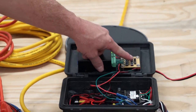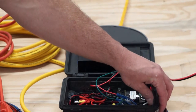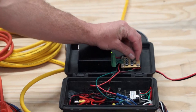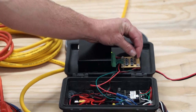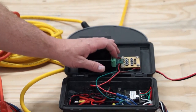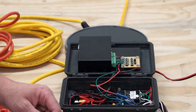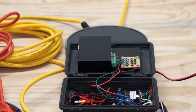If you'd like a different tone, place the jumper pin across any of these pins. Right now, if I press the button on the outside, it is set to the tinkerbell tone. If I want to set it to the next one, I take out the jumper pin and put it to a different set, and that changes the sound of the box.